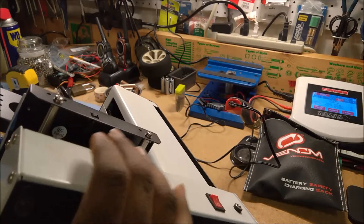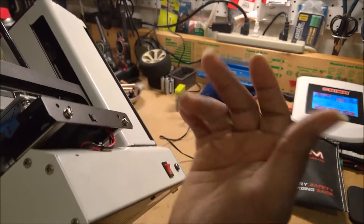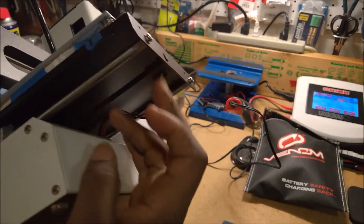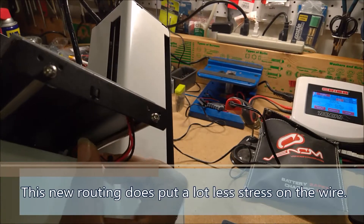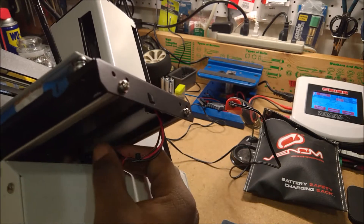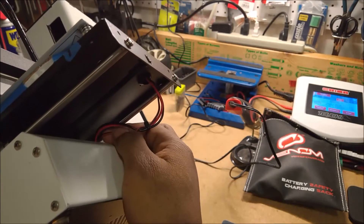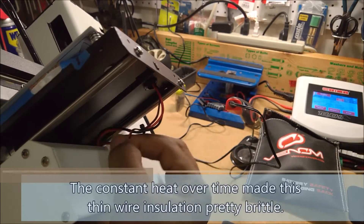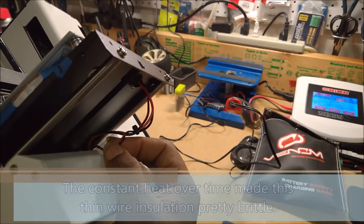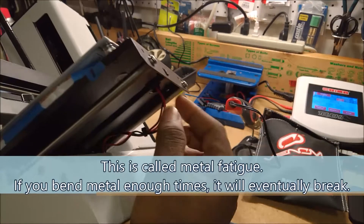The way most guys get around this is they drill another hole in the back of the chassis and reroute the wire — pulling it up, adding wire loom, dressing it up. They change the wire routing because with the current setup, the wires bounce around and can interfere with the belt underneath that connects to the stepper motor and moves the print bed back and forth. Things wear out over time, so that's a big reason why a lot of guys do the mod.